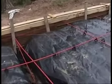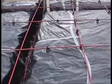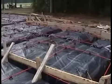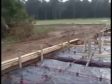My next step is to count the top tendons from side to side. Using the same procedure, I'll start at this side, go 1, 2, 3, 4, 5, 6, etc. Once my count is finished, my field count, I will then compare the number of tendons I counted to, once again, what was called for in the plans.